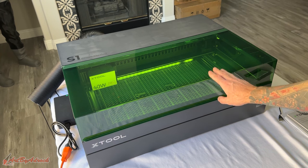Here I am in xTool Creative Space. With the machine powered on, I have this little crosshairs. If I go to the machine and actually move the laser, you can see it moves with it in the software, so I can position my material anywhere I want. If I throw down a piece of wood, I can move the crosshairs directly to where I want something to start engraving. So if I want to go right to the corner of the piece of wood, I can take some text and move it right into that corner.